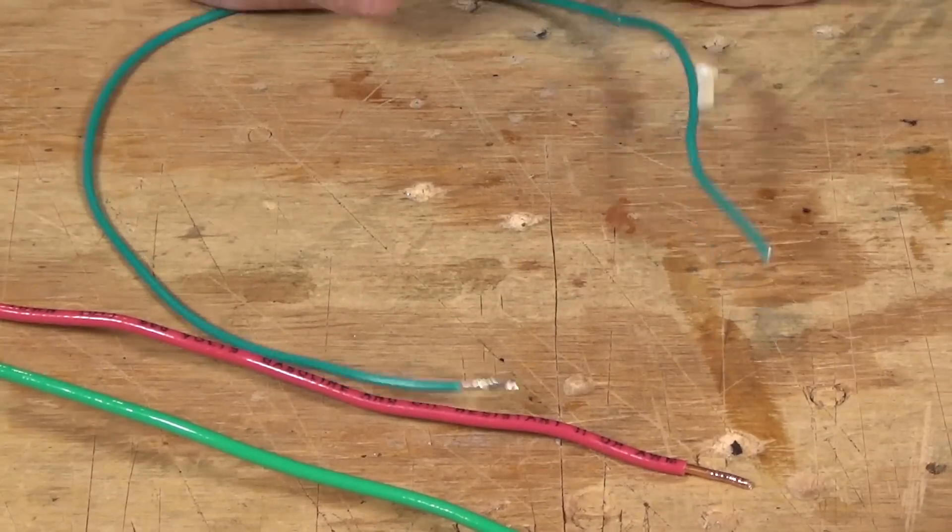So that's five different types of solderless connectors, with a couple of variations thrown in for good measure. These do make your wiring go a lot faster. If you follow the instructions — use the correct size connector with the correct size wire and get a good solid crimp — you're going to get very reliable wiring. In my experience, the people who have problems are the ones who ignore those instructions, use the wrong connector or the wrong pliers, and then complain that it doesn't work. Have a great weekend, and I'll see you next week with another video from The DCC Guy. Bye now!